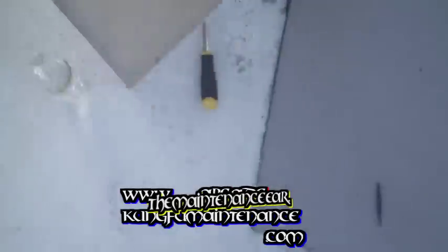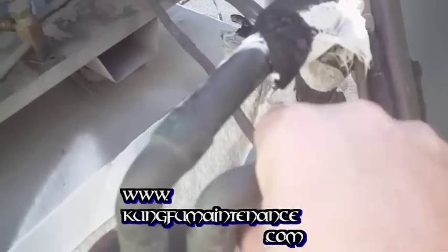Anyway, go back to our unit there. You can see these service mats. You always want to do your refrigerant work and your air conditioning work on the mats, especially if you're changing a fan motor or putting in a new unit. You don't want to put any chunks in the built-up roof material. Anyway, it's getting colder. We're not there yet.